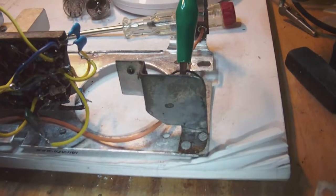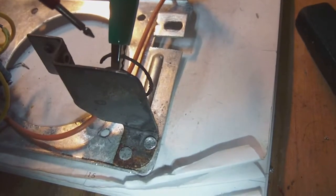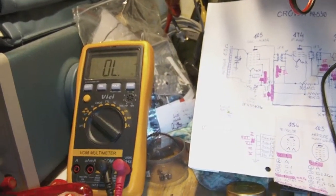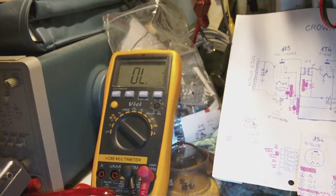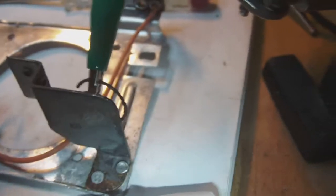the sound back. Just because you assume that the battery would rest with its negative pole on the spring, and that would be sufficient to pass current to the whole chassis, well, you'd be wrong. Okay, so I've got my multimeter on continuity tester. Okay, now I've got my one test lead connected up to the spring, which represents the negative pole of the battery holder.